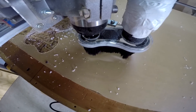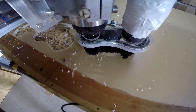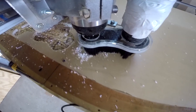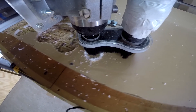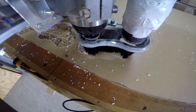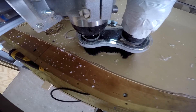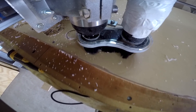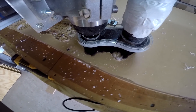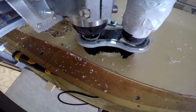We made adjustments on the depth per pass — we increased the number of passes, so we're actually decreasing the depth per pass. The speed in inches per minute was left the same. The chips don't seem to be evacuated until the full depth has been achieved, and then the end mill does a bit of cleanup on that edge on the final pass.